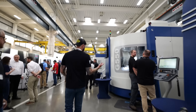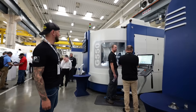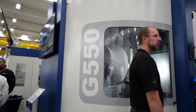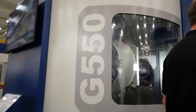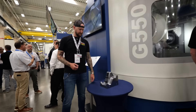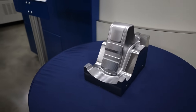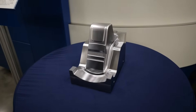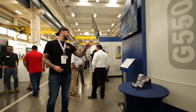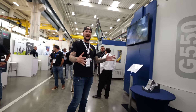Moving along, not only do they do really fine detail work — there's a giant roughing demo going on here. Looks like a two-inch high-feed mill just absolutely chewing material out. It makes sense because you can see they're starting with a big block, and look at the surface finish on what's coming out. Again this one has that 16,000 RPM spindle with 31 by 40 by 38 inch travel, so your work area in there is going to be absolutely huge.